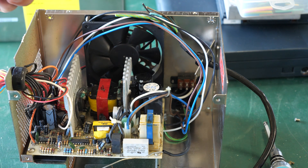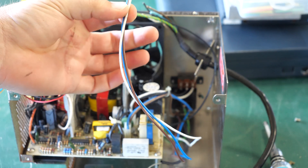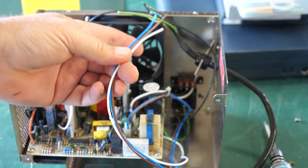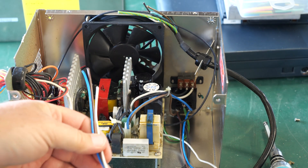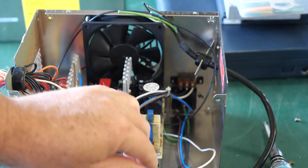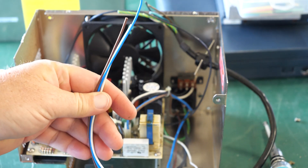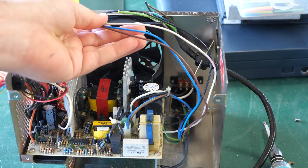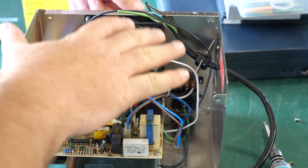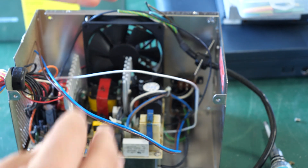Wait a second, what the heck is going on here? So I took a closer look at these wires and yeah, there are just loose wires in here. These wires that I have in my hand are actually wired up to mains — they're wired up to 115 volts coming from the socket and it's not going anywhere. So obviously what was happening here is somebody was fixing this at some point and they wired all the wires up and it looks like they wired them up correctly. And these are all cut off going to the switch and they just stopped there and didn't finish the process. Now, luckily these have not been stripped yet, but if they had, there could be live voltage going through the case here, which would have been really bad as I was holding the power supply and plugging in the 115 volts. If these things had been somehow making contact with the case, I would have gotten zapped for sure.